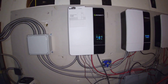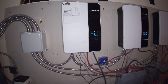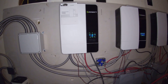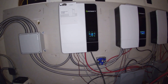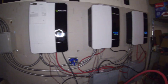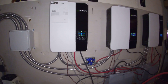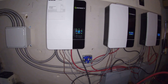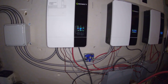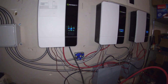This is my GrowWatt 5000ES setup — the way I've connected my GrowWatts to my home power for US 240 and 120 volt power. I have three of these that I purchased from Signature Solar. They're in a parallel configuration, so they're only providing 240 volt output. They're 5kW each, so the total combined is 15kW.